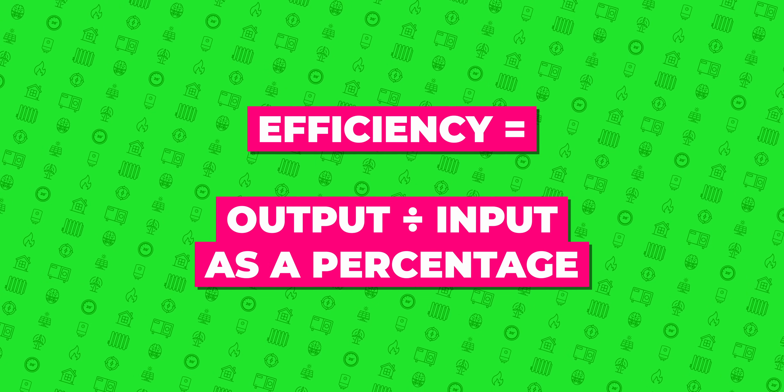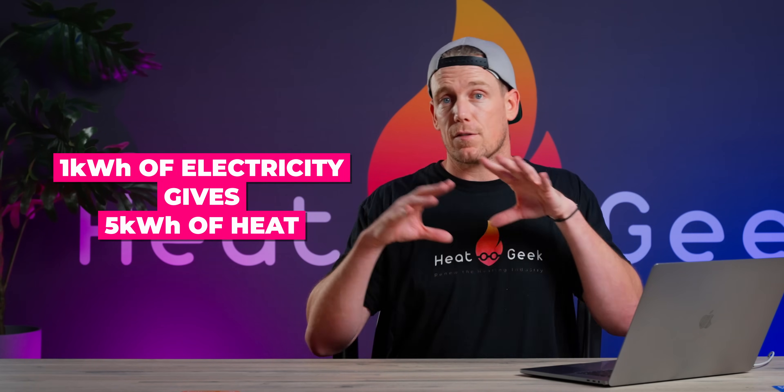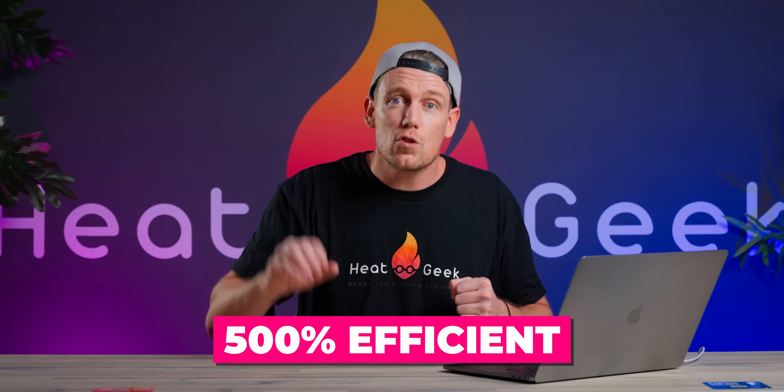So unlike a gas boiler, the actual source of energy for a heat pump is the air outside, not its electrical input. If you did just measure the energy extracted from the outside air, you would have 100% efficiency. If you include the electricity used to achieve that, you would get down to around 66 to 80% efficiency. We don't pay for the abundantly warm air heated by the sun outside — we pay for electricity. So using the same measuring method as gas boilers, and only measuring the power you pay for, if one kilowatt hour of electricity gives five kilowatt hours of heat, the heat pump is 500% efficient.